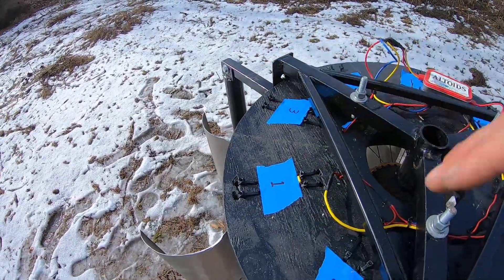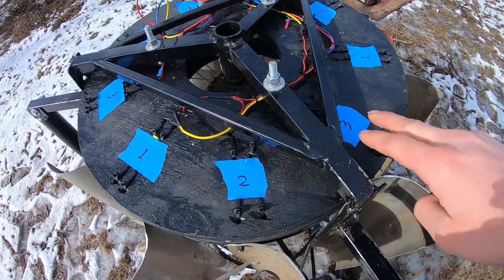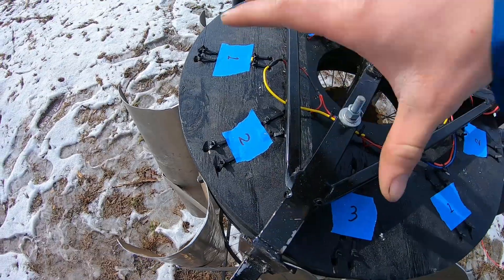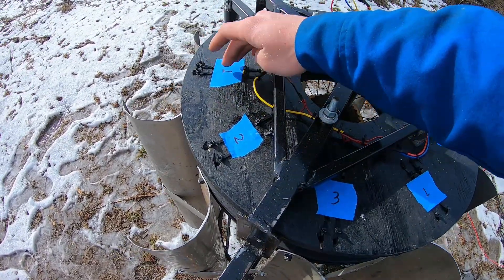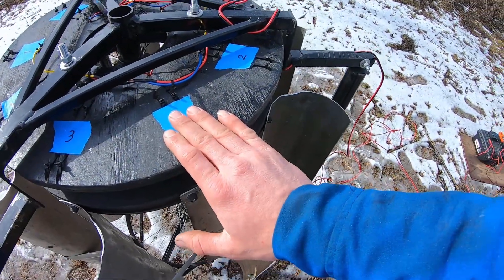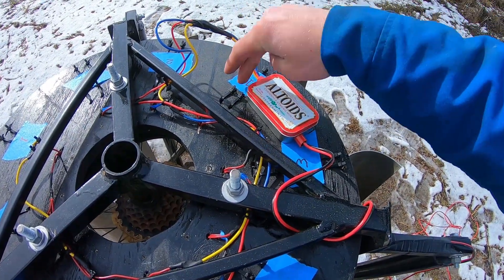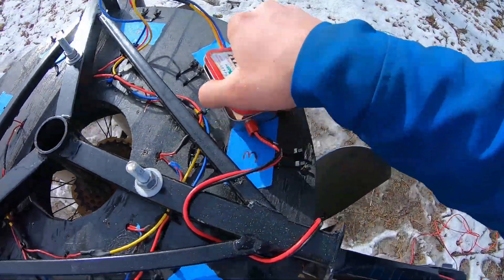What we do is take our first coils of each phase and wire together the inside of each coil in a bundle — all three connections get put together. So let's call this group one, group two, and group three. Our first group of three coils: the outside of one gets wired to the inside of the first phase in group two. The outside of that first phase in group two gets wired to the inside in series. What we end up with is three output wires, which are the outside turn of our third group — first, second, and third phase.